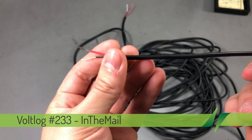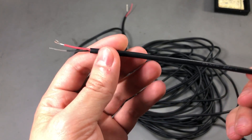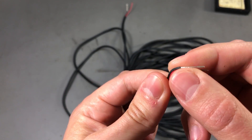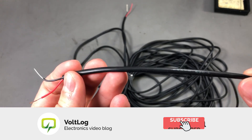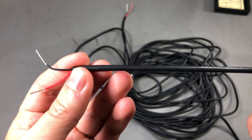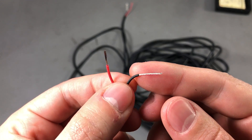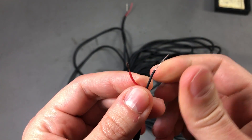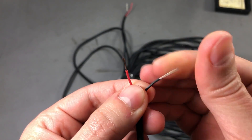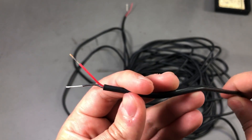We're going to start with this double-insulated wire. Both the outer black insulation and the inner insulation of the wires are silicone — they can take the soldering iron at 300 degrees Celsius without any issues; there is no melting occurring. The one I got here is 26 AWG with about 7 strands inside each wire. It seems to be tin-plated copper because I did the flame test and the individual wires just glow red. I also measured the resistance and it's about 0.132 ohms per meter.